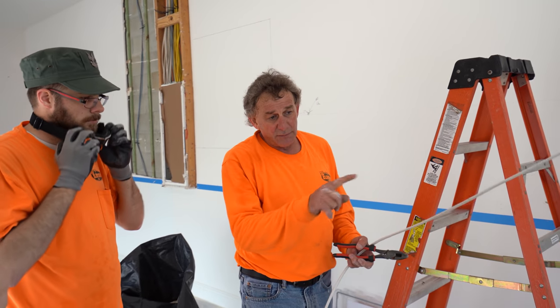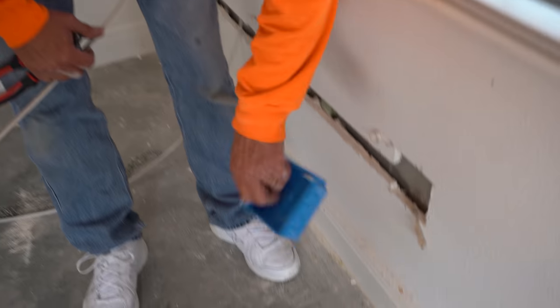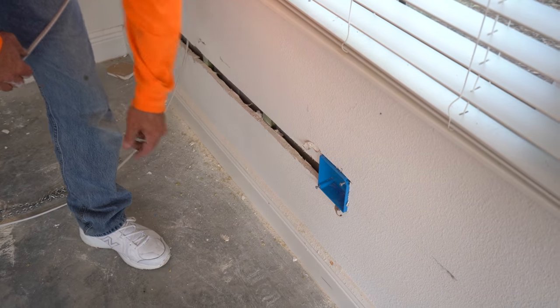We're going to have to carve out the concrete to install the outlet box. The box is only an inch and a half deep and we need to put a P-ring over it - we have to go back at least that far into the concrete. We'll carve it so it goes back about a half inch, and if it's hollow back there we'll just pocket it out. We confirmed there is a hollow cell behind it.